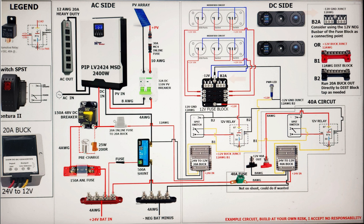You can alternatively use the fuse box — the negative fuse box bus bar is essentially a bus bar with all connections tied together. This is B2A, and you can connect all the B2s optionally to the fuse box bus bar negative side. But then you're wasting the bus bar connections for other circuits you could potentially add to your fuse block. So it's probably best to go with the terminal distribution blocks, B1 and B2. I'll eventually put an updated schematic on my website with the B1 and B2 blocks rewired.